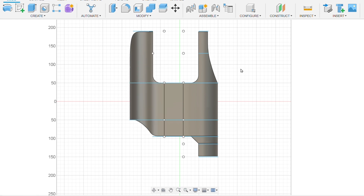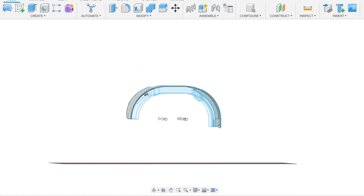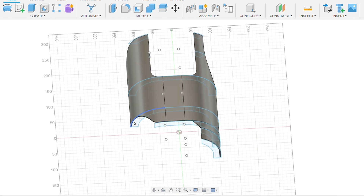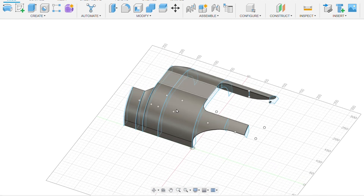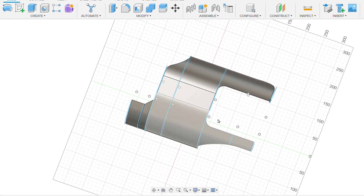With those parameters set, we're going into Fusion 360. Here is the old basic CAD design for the upper arm. Now I know exactly the size and shape of the actuator, I'll bridge the two pieces across the top and create the correct shape in the middle. I'm going to reshape the curve to fit the arm better and angle it in towards the elbow. I'll smooth off the edges, make sure it fits well with the modified forearm piece from the previous video, add holes for actuator cover attachment points, add some details for aesthetics, and lastly add a fairly beefy cover to both cover the actuator and provide extra protection for the user.